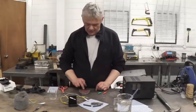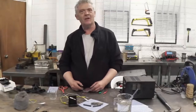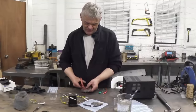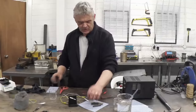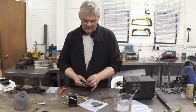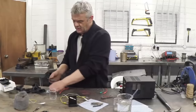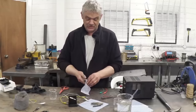Okay, it's had time to dry. It's actually really hard. That little magnesium oxide, magnesium chloride trick seems very interesting. Let's try it on other batteries. Okay, so we're going to make this the same way that we made the Bennett cell, if you remember. We're just going to wind it around there. And this is a carbon rod that I've got here. Put a bit of separator around it and then tie that separator around tight with a bit of string.